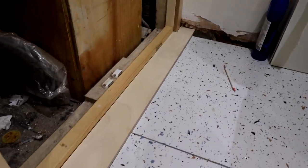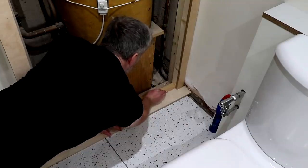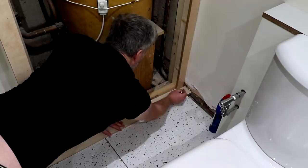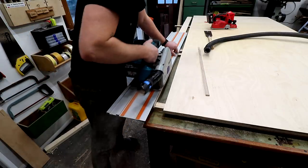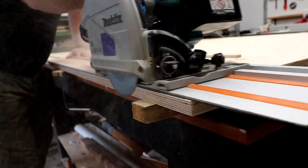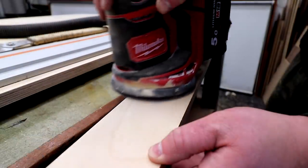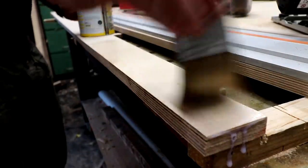I've basically been scribing and hacking away at this workpiece and it's almost a perfect fit, however my line of tiles isn't perfectly straight so while it seats perfectly well at one end it's about a millimetre or two off at the other, so I'm going to plane a little bit off at that end. This was a job that was trickier than I'd expected, mainly due to nothing in the room being particularly square or level. I ended up using the track saw to trim it down and gave it three coats of water-based varnish.